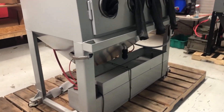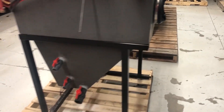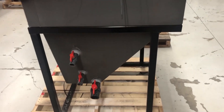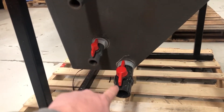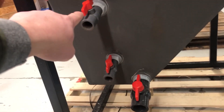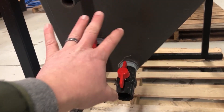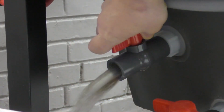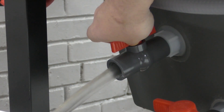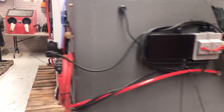When you change the water in a cabinet, you don't have to change the abrasive. On this older weekend warrior, we have provided you with a water drain-off valve right here — this is the main drain, water drain-off, high water level. All you have to do is let the machine rest for a couple minutes after use, then open the valve. That way, only water comes out, not abrasive. The abrasive will settle below that valve, and you can drain the water off. All of these cabinets are virtually identical.